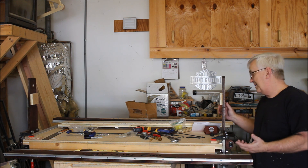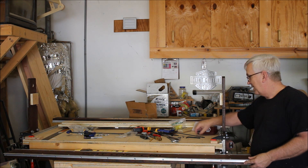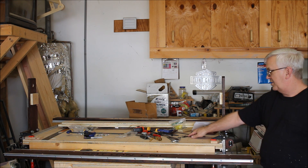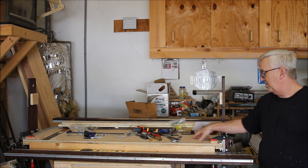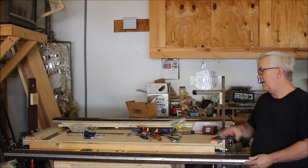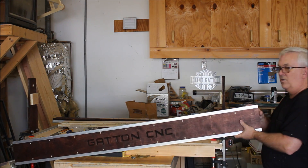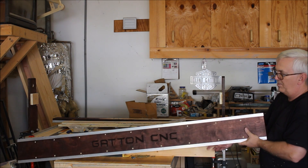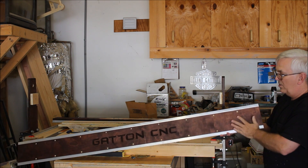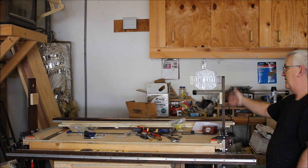This is kind of the steps I like to take — you could do it differently, it doesn't mean you have to do it this way, but I personally think this is probably the best way. What I do is I put the sub-assembly of each gantry upright and get it put on the rails, and then I can check to see if I have this perpendicular to the table. Once I have that perpendicular, then I do the other side, and then I'm ready to move forward with mounting the different pieces for the gantry. I like to go ahead and assemble this all together — I've got this front gantry piece, I've got the inside piece that gets glued to the inside bottom part of this, and I go ahead and drill and mount my rails so I get everything nice and straight.